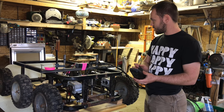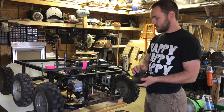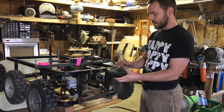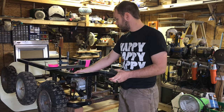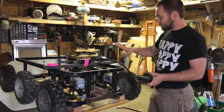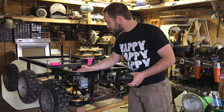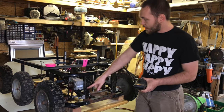It's a skid steer formation so you can go all directions. Right now it's got the original joystick off of the wheelchair. I think I'm going to keep it as a tethered unit for now at least. I just added this bar in too because there was no tensioning for the drive chain, so they would just fall down. I'm going to put them in the back, and in the same process mount the pivot closer towards the middle or front of the motor, so the motor's weight constantly tensions it.